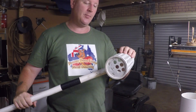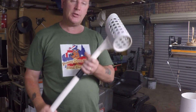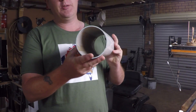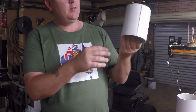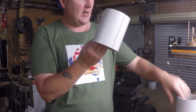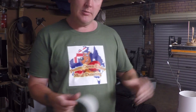That's a bit of down pipe from the gutter and this is just normal water pipe. I've already cut a few pieces here - there's the piece that's gonna be for the bottom, and then a smaller piece here which I shall cut, open up and flatten off with a heat gun so I can make an end cap for the end.